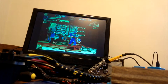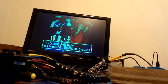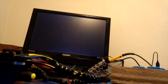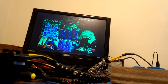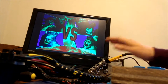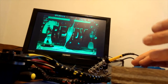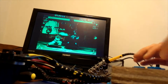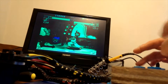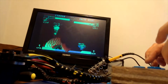It's going to be quite a long video, but I'm just wanting to actually play this a little bit in case it does seem to die after the battery change. I did have one game die on me, I think, because of a battery change. So I had the soldering iron on for quite a while, to make sure everything was nice and hot. And I got a good solder onto the solder pads so the battery went in nice and quick.